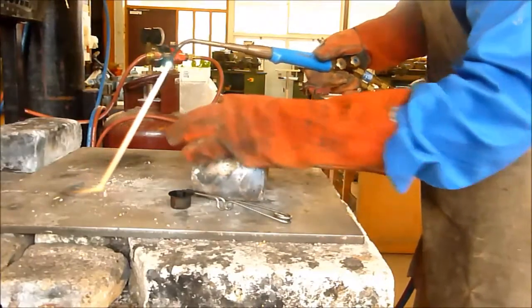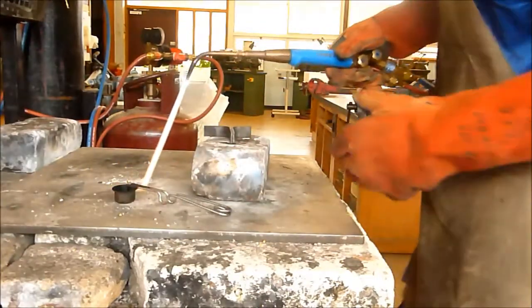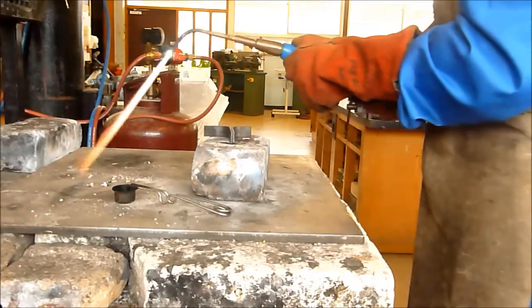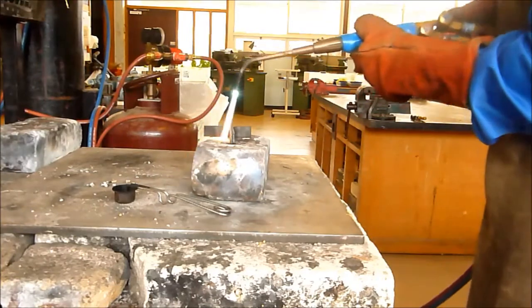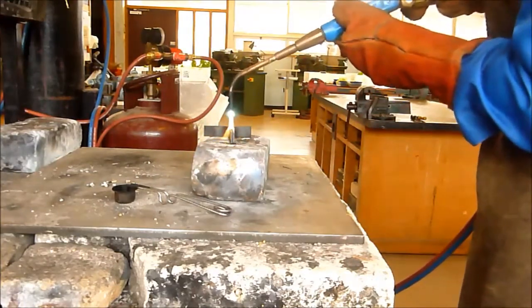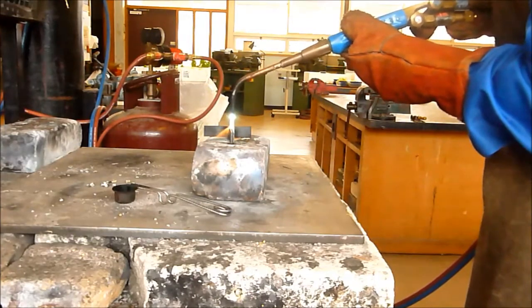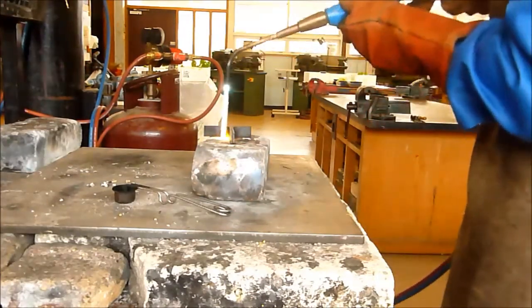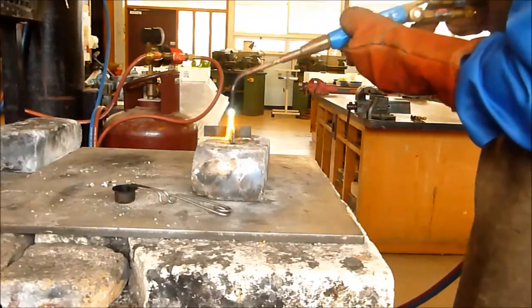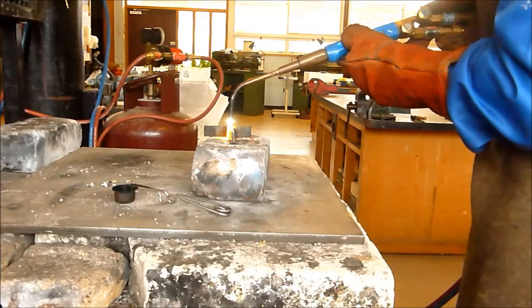Today I'm going to tack this work piece. The number one thing in setup for a weld is position. I always start by getting my torch and going vertical — so if you see the cone, it's going straight onto my work. It's not pointing out, in, left or right, it's straight down. Come in straight vertical and then throw it back about 20 degrees.